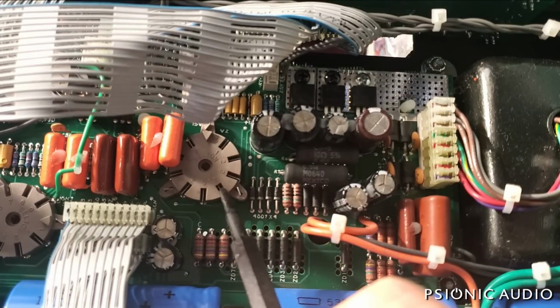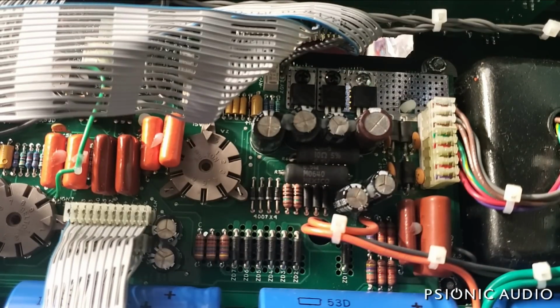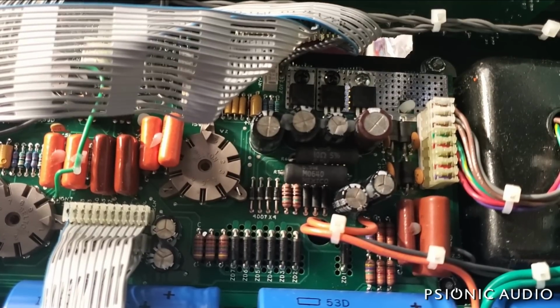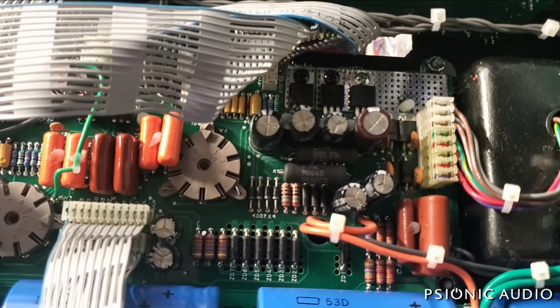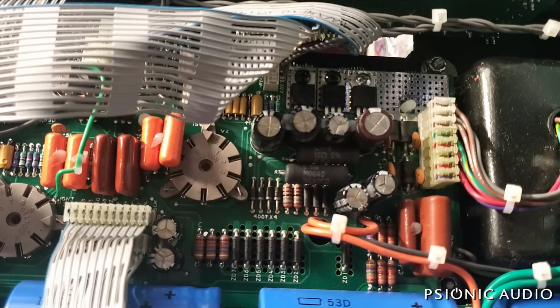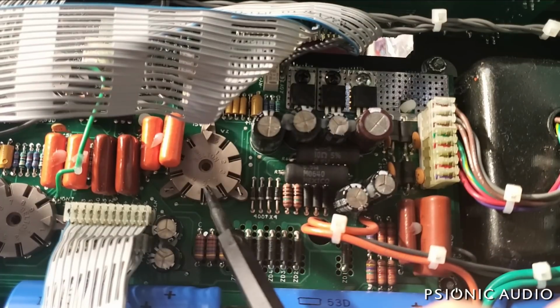that V2, which is the tube which is introducing the noise into the circuit, is the only tube in this amp, of the three preamp tubes, that has a DC power supply. If I pull V2, all that noise goes away. And I'm suspicious of its 12-volt power supply.